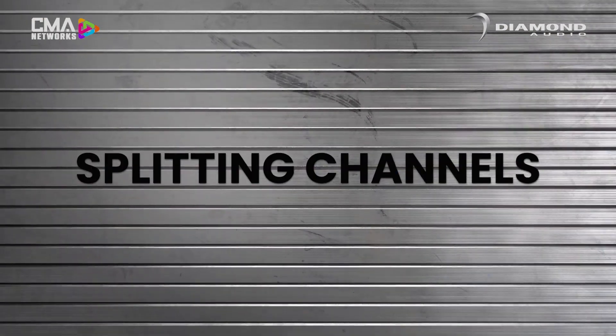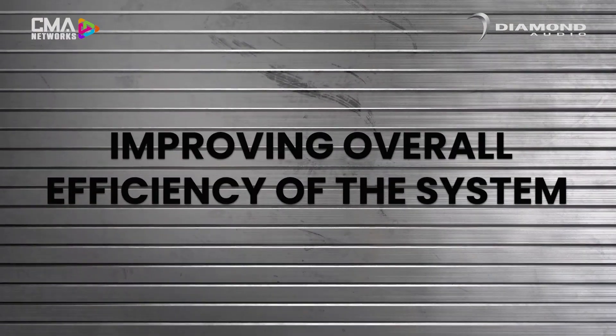Another great utilization of the DSP is splitting channels. If you're using a DSP like ours, you're getting 10 volts of output. So if you need to split channels — say you're running multi-channel amplifiers — you can split those channels and have confidence that you're still going to have lots of output voltage, so you can keep those levels down and have very little chance of having any kind of noise situation. If you're using a normal source unit, at best a marine unit not including ours is only going to give you maybe two volts of output. Having 10 volts of output means you can put multiple amplifiers on a single channel and not have to worry about loss of signal, loss of sound quality, or introduction of noise.